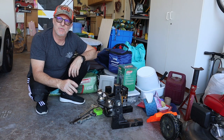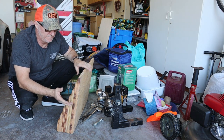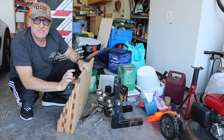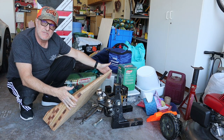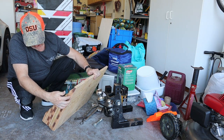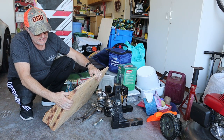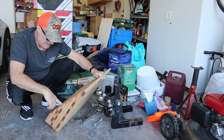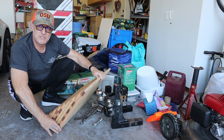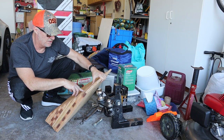One more thing I wanted to show you — the ramps I built. They're just three-quarter inch plywood — about $24 for one sheet at Home Depot. I went with 18 inches on the biggest piece at the bottom, had them rip the plywood into four equal pieces, 24 inches wide. I did calculations based on my longest piece being 18 inches and figured I'd have enough to build them from one sheet. The bottom piece is 18 inches, then I stepped it back two inches each time, down to four inches for the shortest piece, giving a total rise of six inches — the size of the curb.